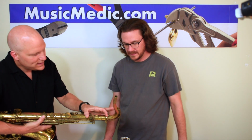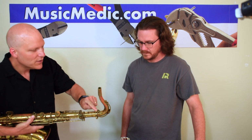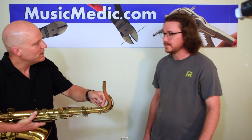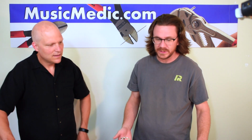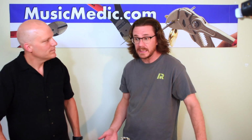The top part of the octave mechanism has several pieces that go together, and each of those could have some play in the rod if the swedging wasn't tight. Then you might have lost motion between your octave stem and your neck when the player finally puts the horn together. And to add the cherry on top, your neck key could be loose. There are a couple of different ways to take out that lost motion. A modification that we really like doing in the pro shop is the Teflon ball Octave Rocker.